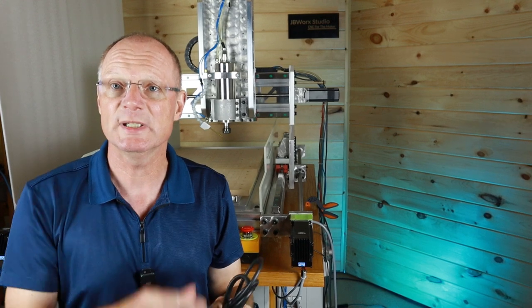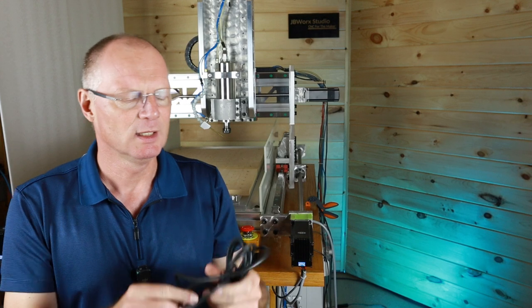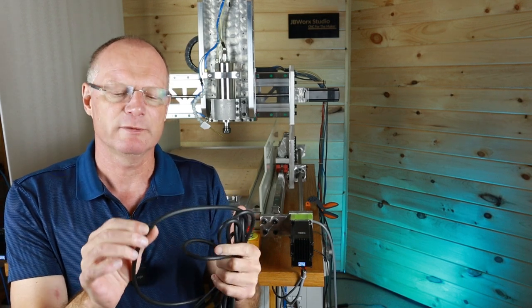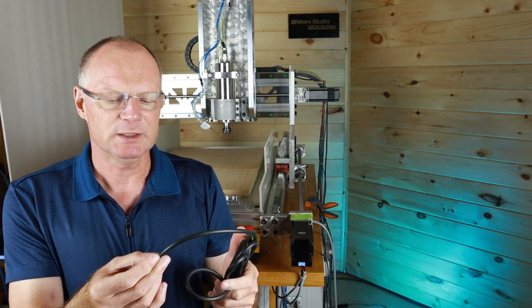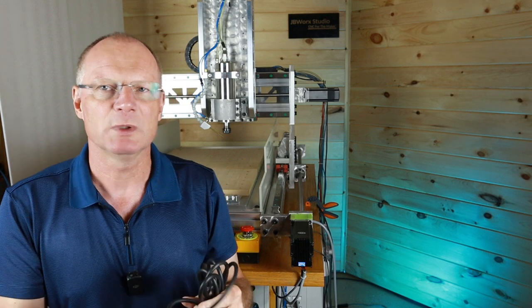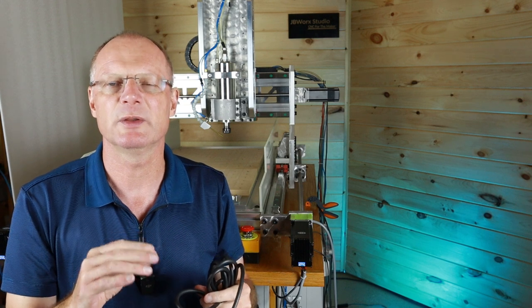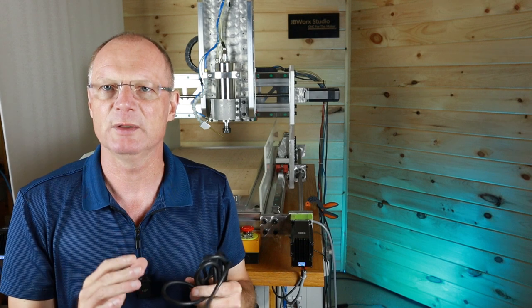Well, for you, because you hit the like button, I'm going to have an extra tip. Matter of fact, two. And that is an aspect to the seal. Make the seal out of a foamy, squishy material. The reason for that is that it needs to compress. If you make an O-ring, the O-ring will not compress. It's very difficult to compress it down into the groove, and the groove needs to be designed just correctly for the whole thing to work.